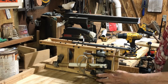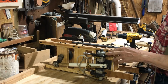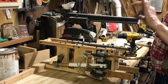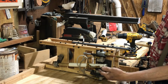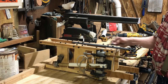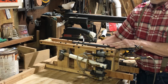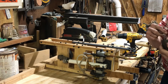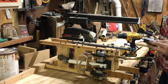These valves, I made them with a diaphragm on the inside, which makes it sealed, airtight, but the size of the diaphragm increases the pressure that has to be put on each one of the plungers in order to operate the valve, and that's making it too stiff. So I'm going to change them out, put my older valves with the stem and an O-ring seal around the shaft. I think they'll be sufficient for the pressures that we're going to be running now.